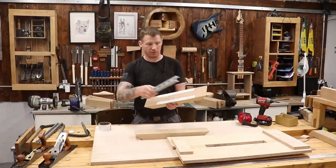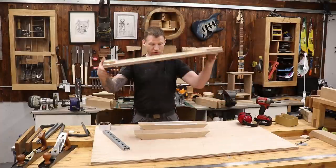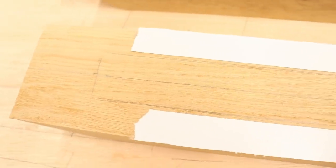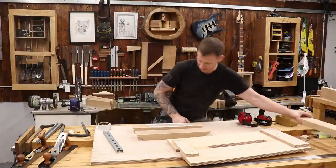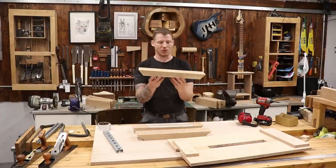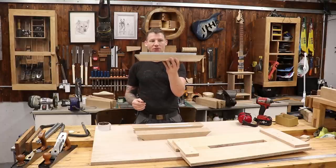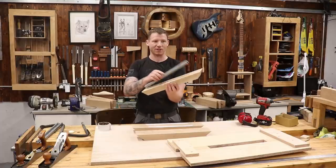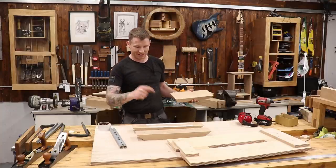I'm routing the unistrut into the center of the top pieces. I've built a simple router jig with a slot in it to drop over these so I can rout out the slot. I'm using a router bit with a bearing to follow the inside of the plywood jig, with double-sided sticky tape to hold it in place. I'm also thinking about using the piece I cut the angles on incorrectly as a center brace in between the two legs — hidden under the table — to help keep it straight. But for now let's get the legs done and glued.